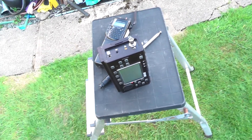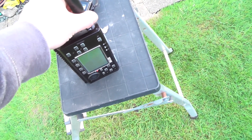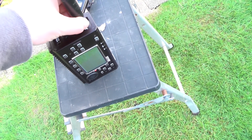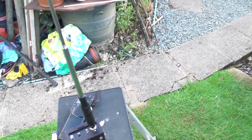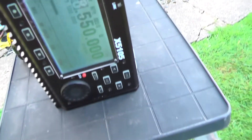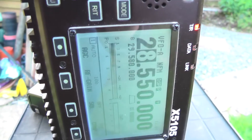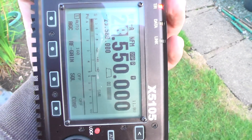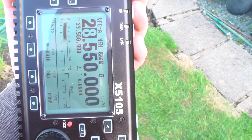I'm thinking it's a faulty antenna, or it could be a faulty antenna socket on the radio itself — it needs to be looked at. So I've swapped over to the new antenna and extended it up. There's the new antenna on top. Let's check it — you can see the audio is stuttering. I'm keying up on narrow FM, so I shouldn't be doing that. But yeah, the SWR is nice and low, though it's giving me stuttering audio when I transmit across the band.